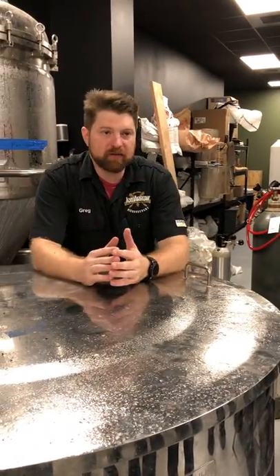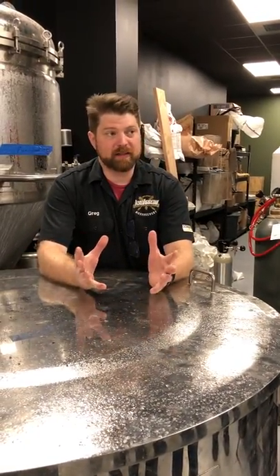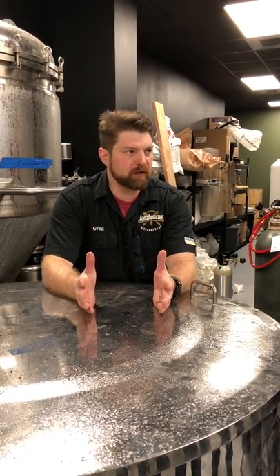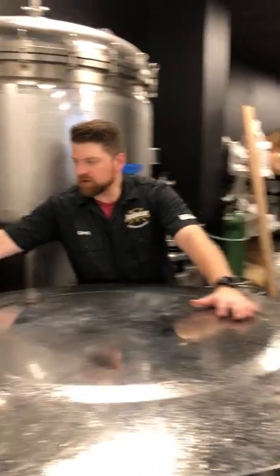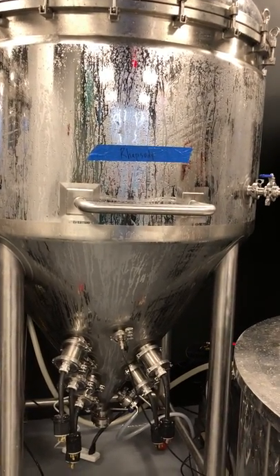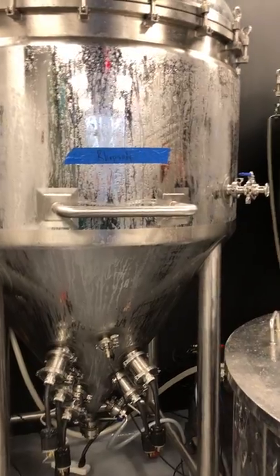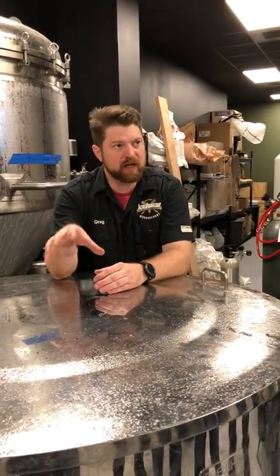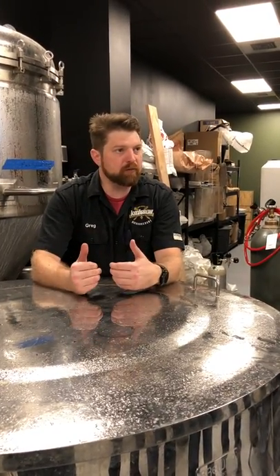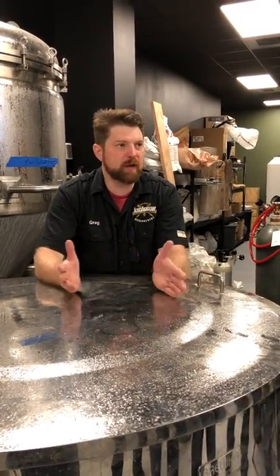The advantage that gives us is a couple of things. One, fewer vessels to actually clean. So instead of having to clean out a mash tun, a boil kettle, and then into a fermenter, it all stays in the same individual vessel from mash-in until we transfer to keg for service. It's a full conical pressure vessel, so it can act as a bright tank as well. So we clean up and carb inside one vessel. Also, because it's boiled inside of that vessel, everything's heat sanitized. All we have to worry about when we're cleaning is getting it debris free — no chemical sanitizers used. It's all heat sanitized.